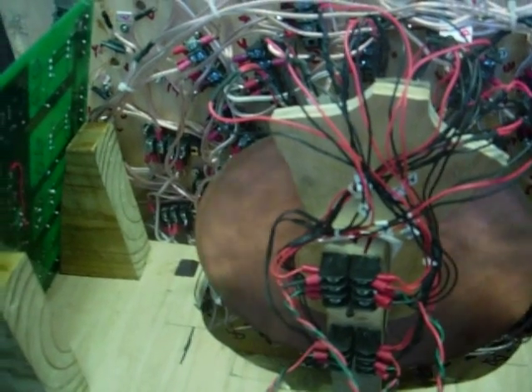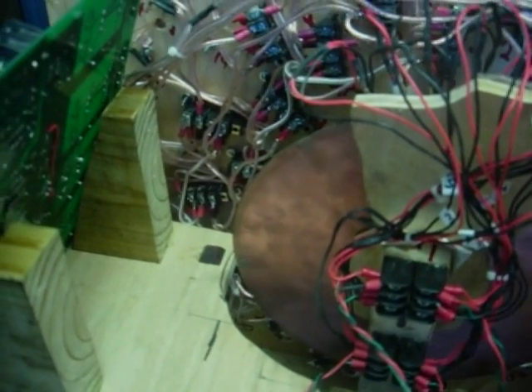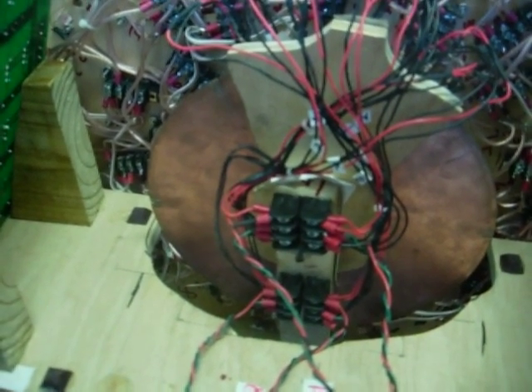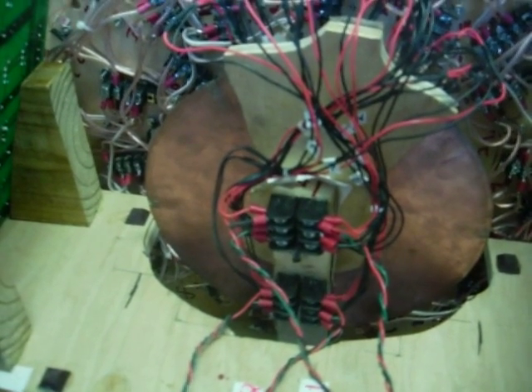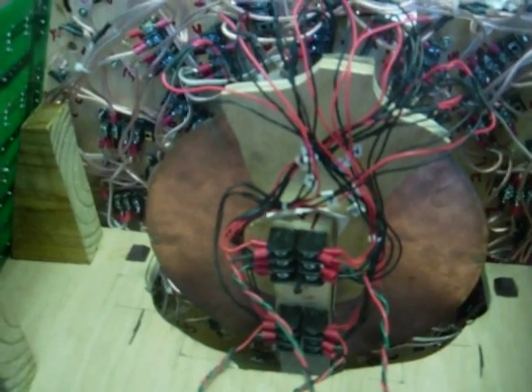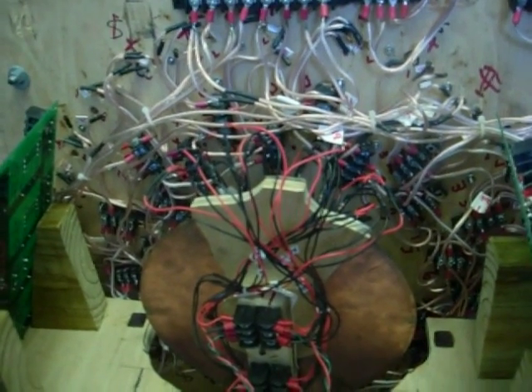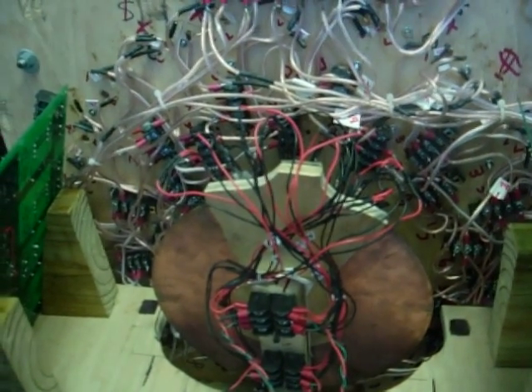When I kick this thing up to a hundred volts it ought to be really flying. I may have to change this disk arrangement if there's any vibration — there's not a lot of room to work with in here. You can see that every sixty degrees there are the three cuts, done with the Dremel tool. The reason for going out to ten inches was that on a CD disc I simply couldn't get the three cuts made in that small surface area. And when I tried to use a 33 RPM record album, the plastic was so brittle that once it touched one of these wires it just split the record into pieces — quite a mess.